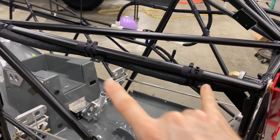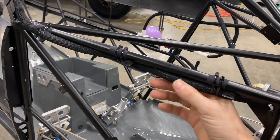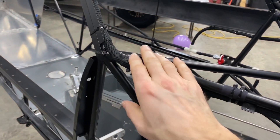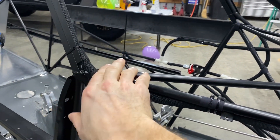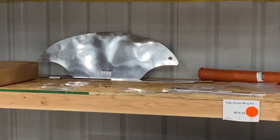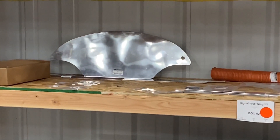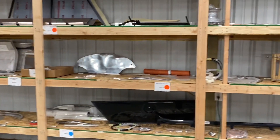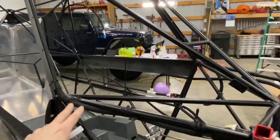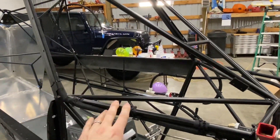The instructions show the fuel line coming up right through here, but right here these two tabs are where the electronic ignition goes, so I held the line back for now. The panel sits right here too — that's what a raw panel looks like. My panel is being made by Cub Crafters with the avionics already in it, but it's great that they supplied a blank one because I used it to mock up clearances. The fuel lines look like they'll clear right where they are, and it's zip tied so I can move it easily.